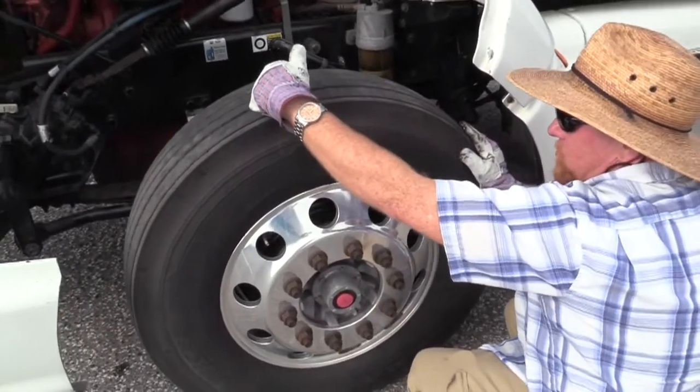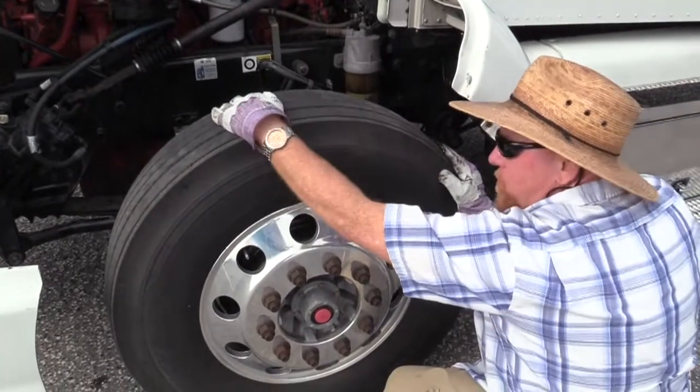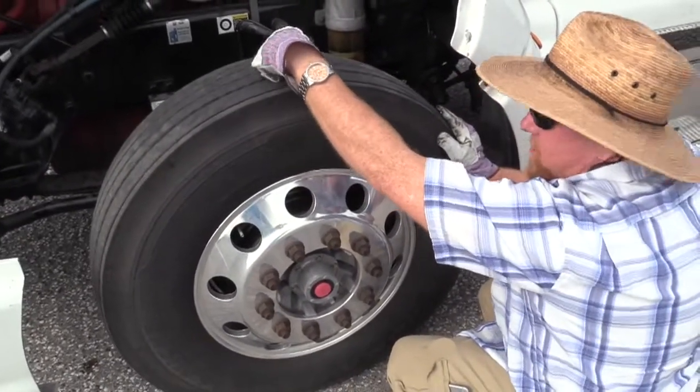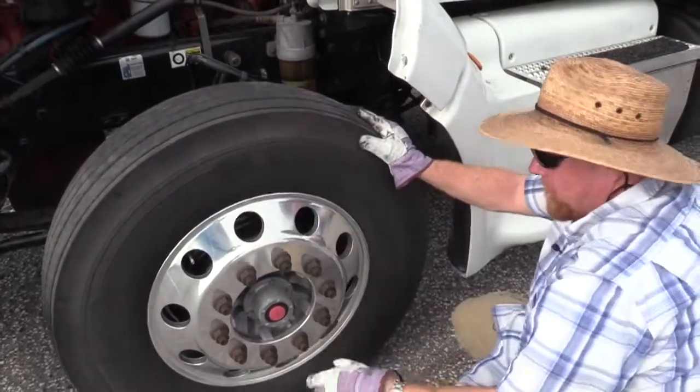They will measure that on the road at the thinnest layer you have. They're not going to find the thickest amount you have to measure. They will go to where it is worn most, and measure that. So make sure that part is at least 4/32.